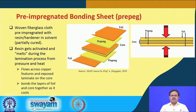The resin in the prepreg gets activated and melts during the lamination process under pressure and heat. Looking at the diagram, we have a CCL at the center — one fully cured laminate with copper traces on the top and bottom. On top and bottom of that, in a multi-layer circuit board, comes the prepreg, which is also a laminate but partially cured, and on top of that there will be another copper foil.